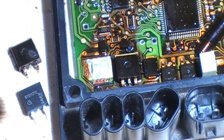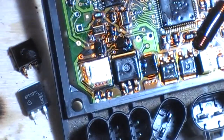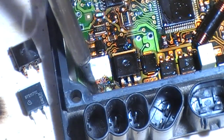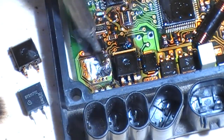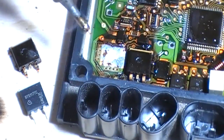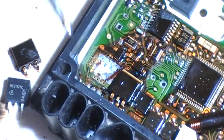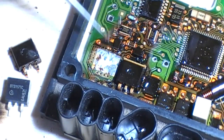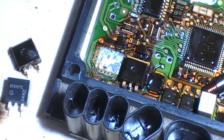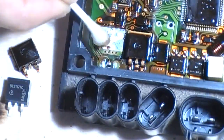Now we're going to come back in with the iron and some flux. I'm going to clean the whole area because it's still got the mask on it and stuff. Start by removing all the coating. Sorry, we don't want to move the mask. We do want to remove the coating so that we get the new one to sit just where we want it. Okay. Come and lift all that junk away, like so. Come back in with the acetone. You know, I spend more time acetoning things than a nail salon.